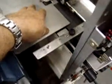The only thing that's really required to change sizes, of course, is you have to keep in mind that you have a different plate for the different size booklets. This will handle up to like 12 by 18. You'll need another smaller plate if you're going to go to 8 1/2 by 14, and another one for 8 1/2 by 11. We provide 3 stitch plates with this machine. We provide the 11/17 plate. We provide an 8 1/2 by 14 plate and an 8 1/2 by 11 plate.